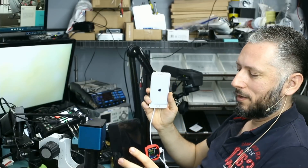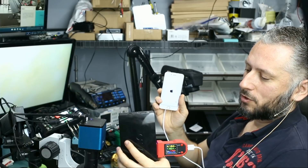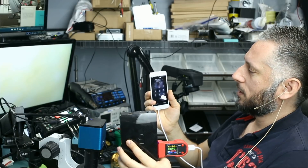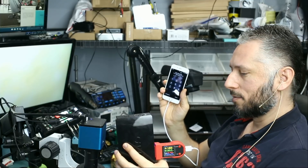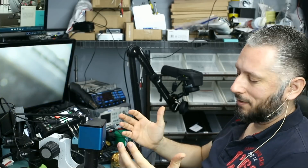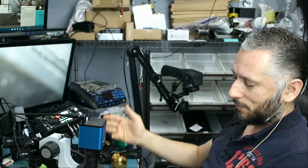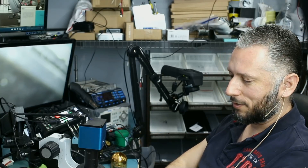So what did we do? We replaced the MOSFET, we replaced the Tigris chip, we removed the shorted capacitor that we discovered under the thermal cam, and we removed some capacitors next to the MOSFET but replaced them with only two caps. All we have to do now is back up the phone for the customer. I'm very happy — my time did not go for nothing. I'm glad the phone worked out and I'm sure the customer is going to be very happy to know we were able to get his data back. That's it for this video. I hope you enjoyed it — don't forget to like and subscribe, leave a comment if you have any questions, and we'll do something else in the next video.